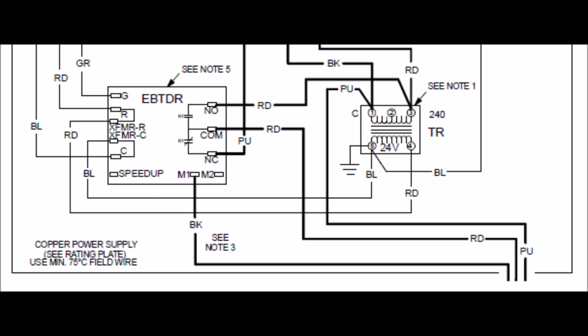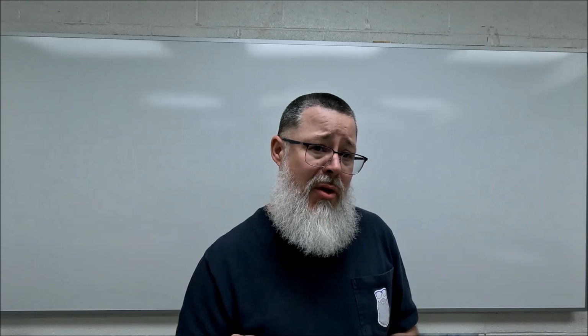I would call that the common side. You'll typically see that on a Goodman air handler, and there's nothing wrong with it. Common is worth 0 volts, and ground is worth 0 volts, so there's no conflict of interest. R has the power. So let's go to terminal 4, which is where our red wire is, and let's follow the flow. It's just like an L1, except it's low voltage, so it's R.